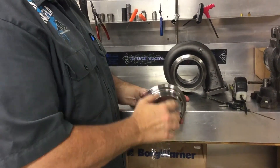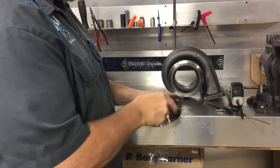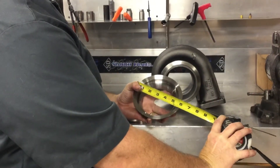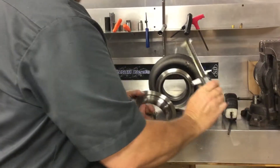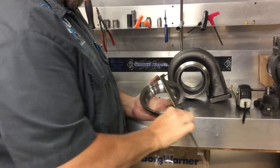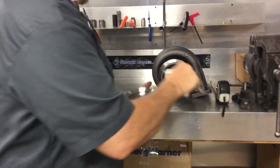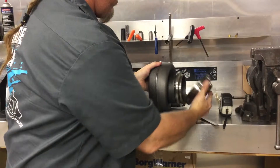It's tapered down, as you see here, to be used with 4-inch pipe on the inside diameter. The outside measures five and three-quarters inches with a tape measure. With digital calipers, it comes in at essentially the same — right at 5.79 inches — so just a hair over five and three-quarters. It also has a really good tapered sealing surface.